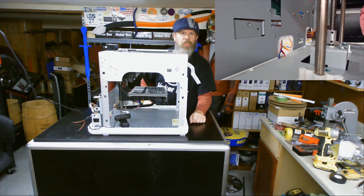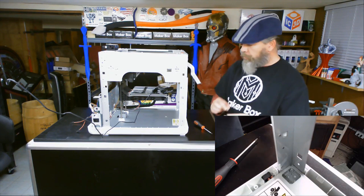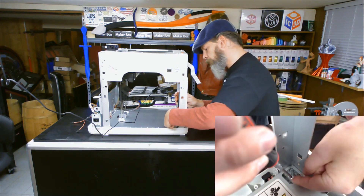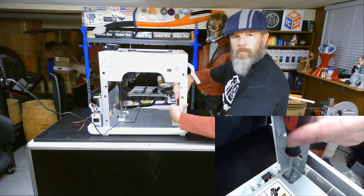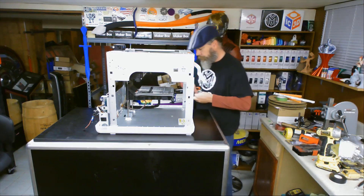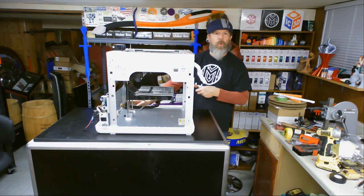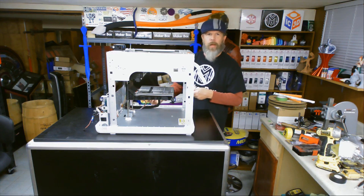Now we've got the wire through the opening. We can go ahead and set the printer in its proper place and let it seat into the base. All that's left to do now is put the four screws in the corners and our base is mounted and our on-off switch is in place. I've got four 12mm thread-cutting screws — insert one in each corner. For the back right corner you'll need to take the screw out that's holding your cable chain mount in place, slide the cable chain to the side, put your screw in, then put the cable chain back.